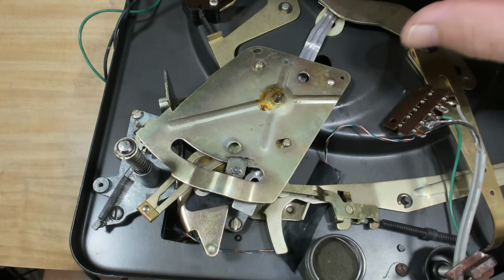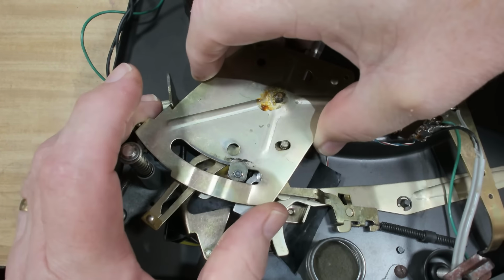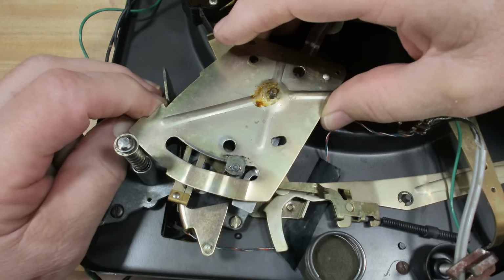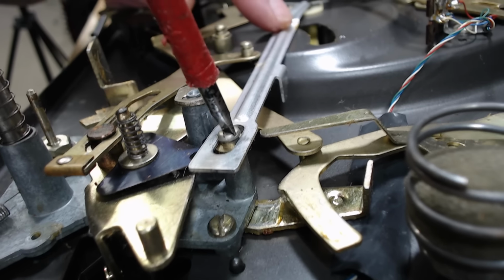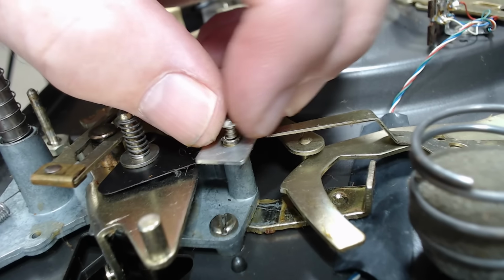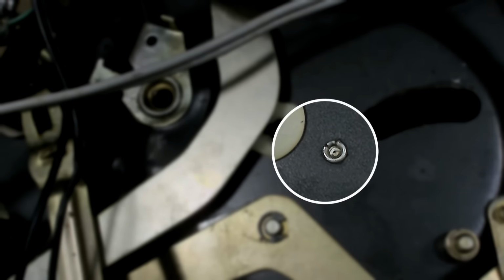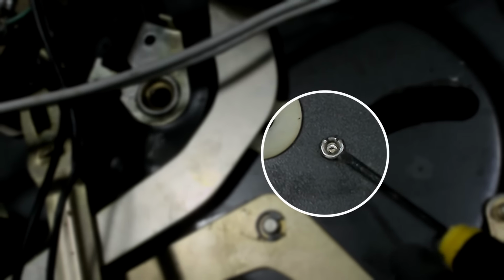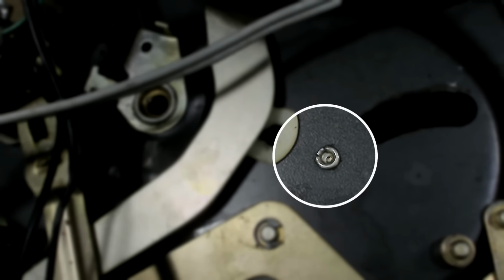Now, to remove this plate is a bit of fun. It's not that hard to get off. He says... Gosh, maybe it is hard. There it is. But now I need to get that off, and I assume it's just this screw stopping it coming out. I've got my hand underneath. I'm just turning the shaft there where the cycling cam rotates or pivots, and it's not that bad actually. But anyway, I'll reset the riveting there, and that'll stop it wobbling at least.